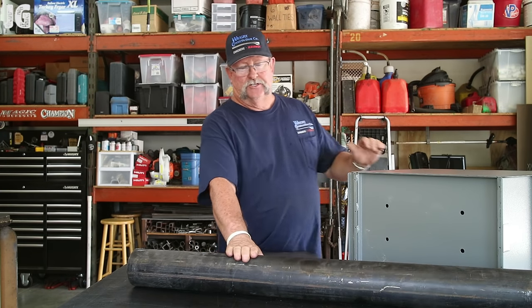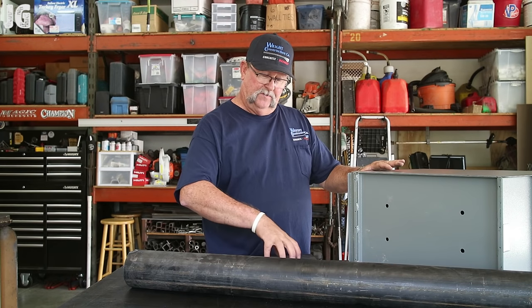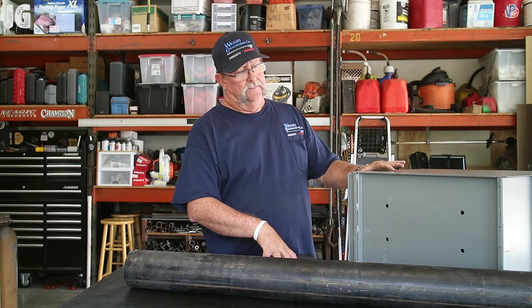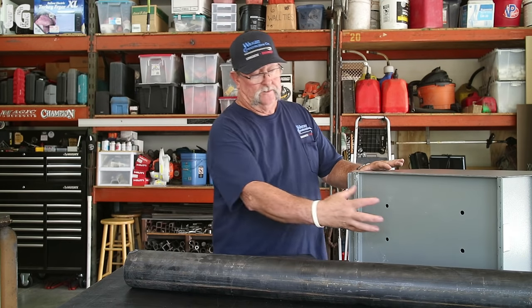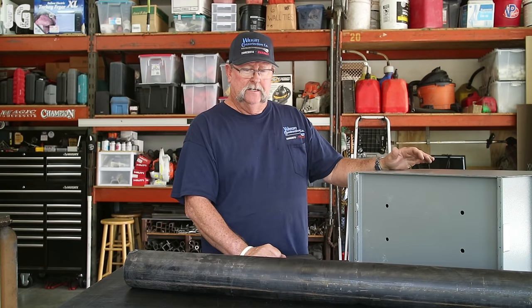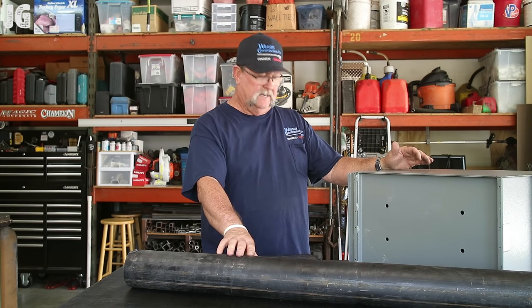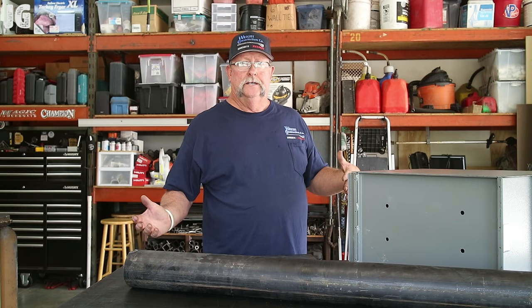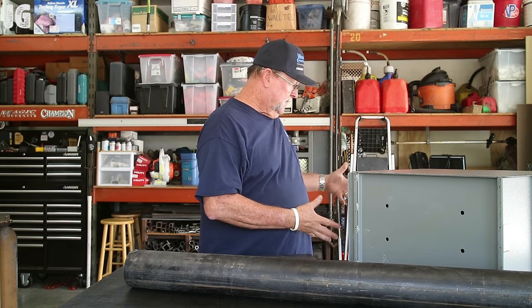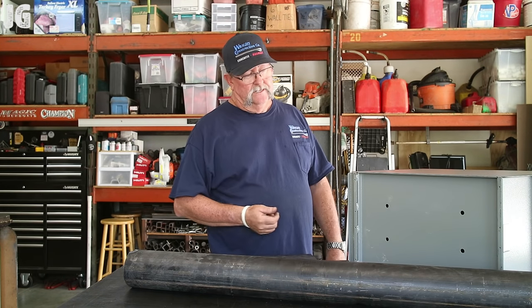And then here's a 3-inch schedule 40 pipe column. I'm gonna go ahead and weld that to this plate. First I'll get the holes drilled where I need to, so this plate adapts to that, and then we'll weld the pipe on there. And then on the bottom of this pipe, temporarily, I'm going to make a temporary stand out of wood so this thing will be able to stand up on its own, so I can build this metal frame around it. That would be more convenient than just laying it on its side. So let's go ahead and get the ball rolling.